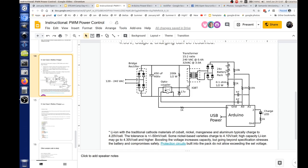Okay. You're saying you're measuring the current at the bottom of the battery pack, but you're measuring the voltage at the top of it, or what's going on there? Well, the current, we're measuring from here, just across that resistor. I did think about trying to put the resistor at the top. Hold on, how come you're saying you're measuring it across it, because you're measuring that through that 100K for A0? No. So you've got ground, and it goes to one end of the resistor, and A0 goes through 100K to this one. And so effectively, there's zero current going into the Arduino. It's in the nanoamperes, really small. We're letting just enough go through the 100K resistor and that 4 nanofarad capacitor to give us a balance.